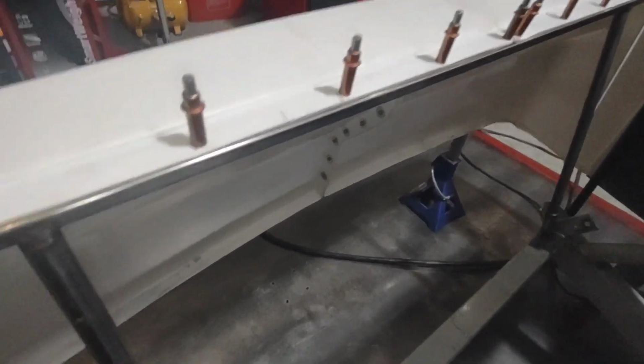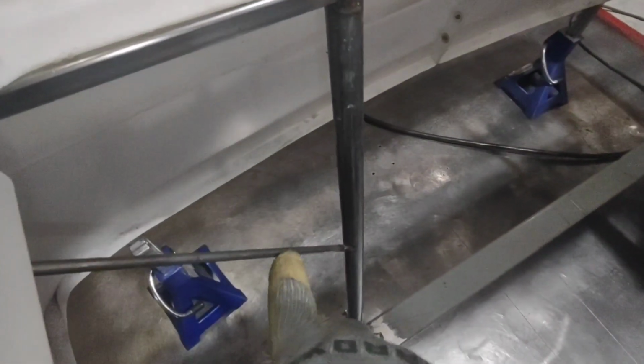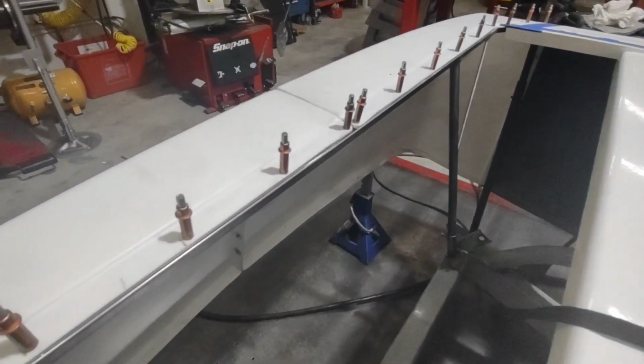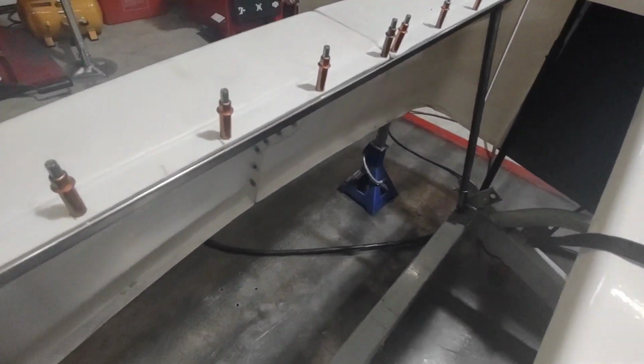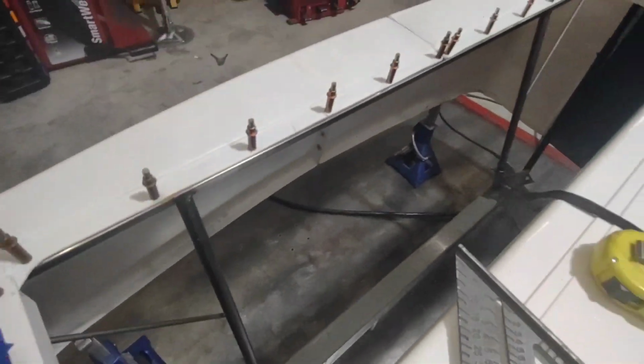I'm going to go ahead and hop in here and weld this stuff up. I've double checked it all. I'm happy with it. I'm going to weld the bases. I'm going to weld this lower portion of the gusset bar, and then I'm going to pull the bumper loose, lift it up so I can weld the rest of that. I want to lock all this down to ensure that it doesn't move, and I can pull my roof jig off.